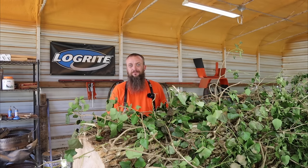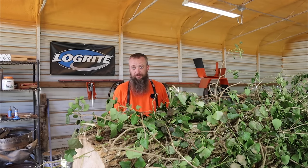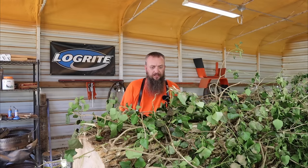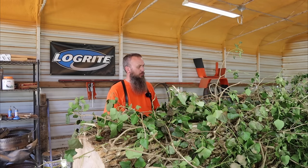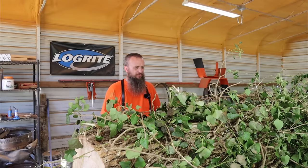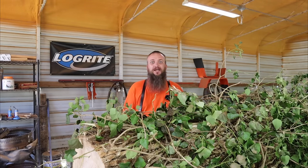And there's also a lot of good firewood that comes from ash. Ash has an extremely low moisture content, so it doesn't take it long to air dry for lumber and also dry for firewood. Now today we're going to be sawing this in 6/4 on the thickness. Hopefully here in about a year or so, maybe sooner than that, we'll have some nice blanks for tool handles, for axes, for hammers, and stuff like that. Ash is a really good tool handle. I think hickory's the best. Ash is probably the second best as far as that goes.